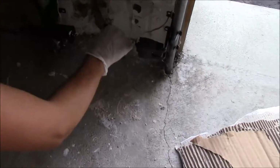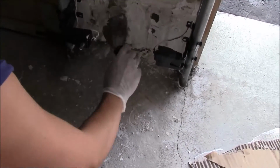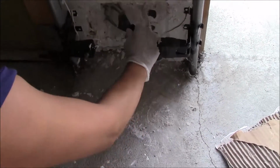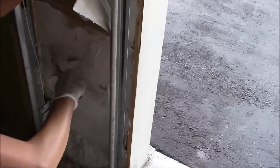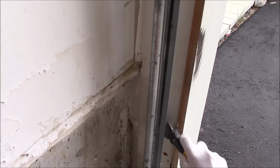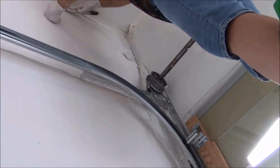First, apply the drywall compound on the spaces that are damaged, apply the first coat, and come back another time. Apply a second one. Leave it to dry and come back again until you get a nice surface. On the places where you found loose paper, apply the drywall compound and stick the paper back on. If you find some open spaces like this, first fill them up with cardboard and then apply the drywall compound. Look around on the ceiling, on the wall, in the corners, and see if there is any detail that you can fix with drywall compound.